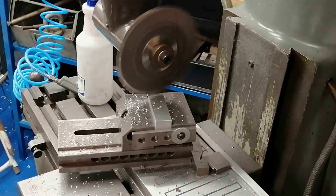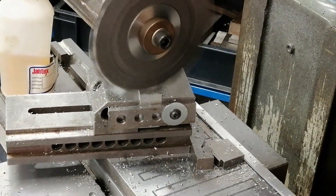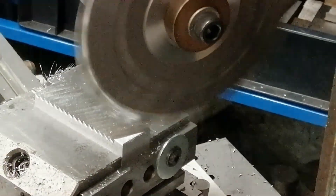And finally, those mirror-angled serrated blocks that are such a pain to align — using CAD, a magnetic chuck and a sine bar really helps. Still takes patience, but at least you can see what you're doing.